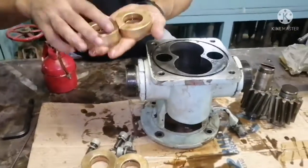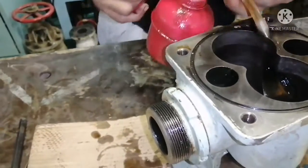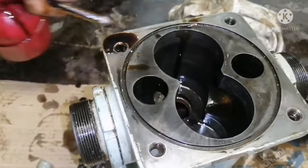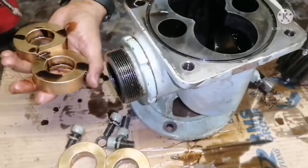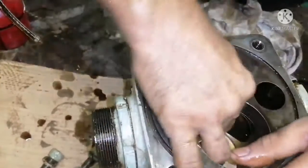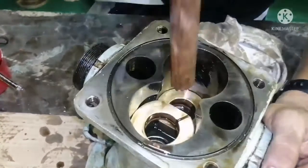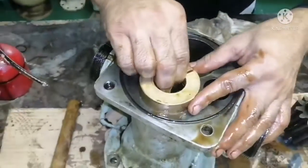As I said earlier, this bush should be on your suction side, so I'll put the bush in the suction side. Before installing, ensure your casing is clean and put some oil. Fit it in place very carefully so that you don't mismatch — sometimes it gets stuck and that will cause issues when fixing back. If you need to tap it, use a wooden stick. Don't use any metal because it's brass and it will get damaged.